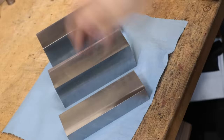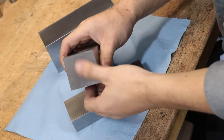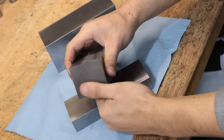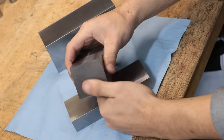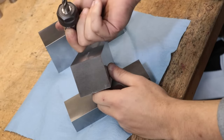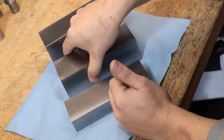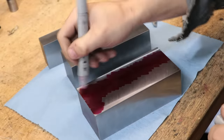Alright, and that's the three pieces cleaned up. It did produce a fair amount of mess though. I managed to do all the important faces, but I'll tackle the sides later — I don't currently have an end mill long enough, and fly cutting tall pieces hasn't always gotten me the greatest of finishes. For now though, we can start to machine the moving jaw, which I'll first mark up.